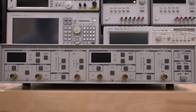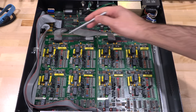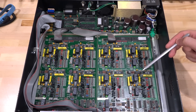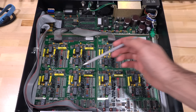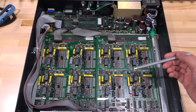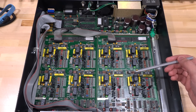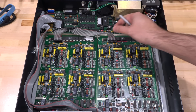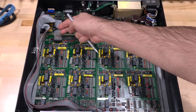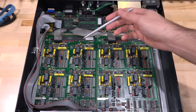Inside the unit it's really nice and clean and clearly has two completely independent filter channels — this is the high pass and this is the low pass. When you make a tunable filter the high pass and low pass require essentially the same kind of circuitry with some minor modifications in where you put the capacitors and resistors, which is why they look essentially identical. We do have an interface for each one — this is the only interface to the main board, so it's clearly controlling with some custom serial interface between the two.